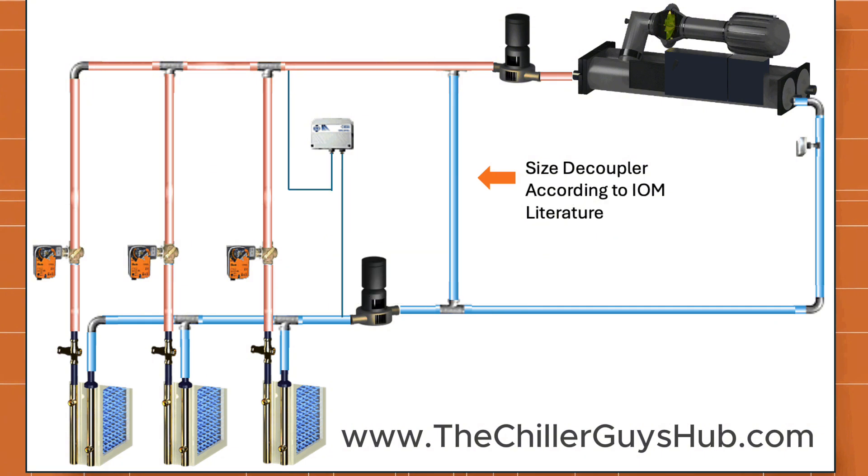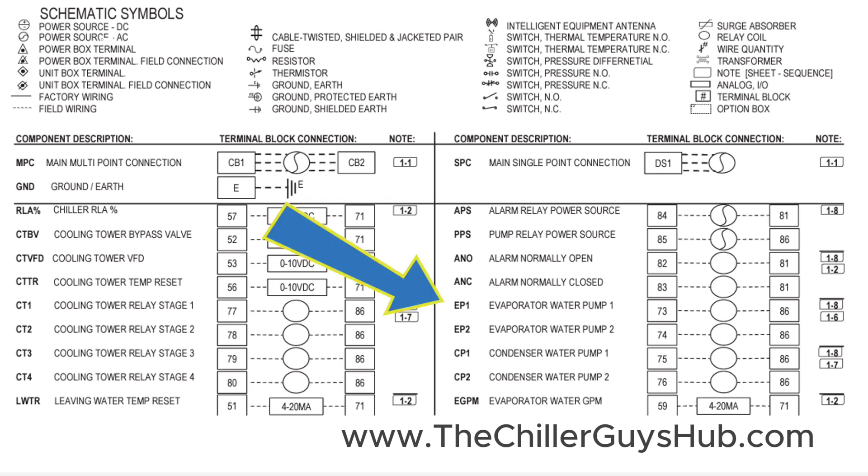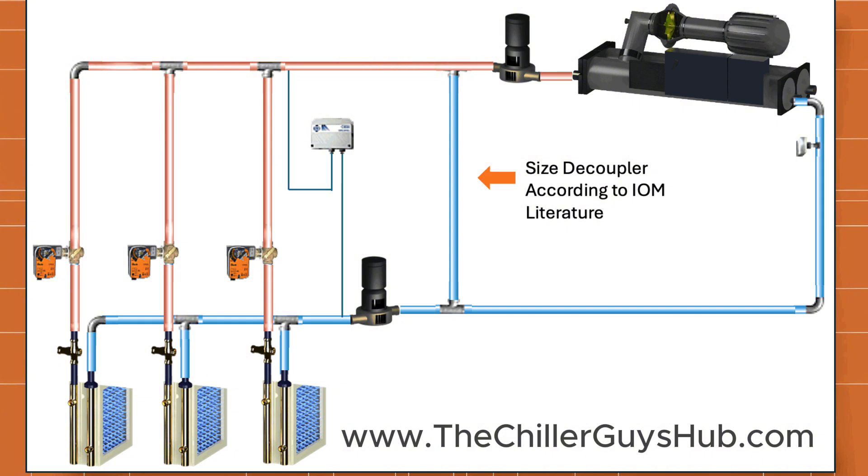The fundamentals of operating a system like this are pretty straightforward. Your primary pump's sole purpose is to maintain chill water flow through the chiller. The best way to set up your primary pump is to just let the chiller control it. If it's on a VFD, the chiller will have a start/stop output on its controller — find the start/stop contact in the schematic and set that up to your VFD to start it.